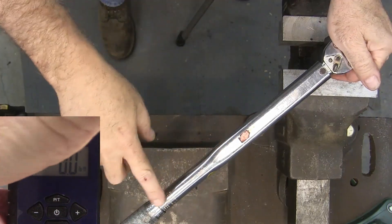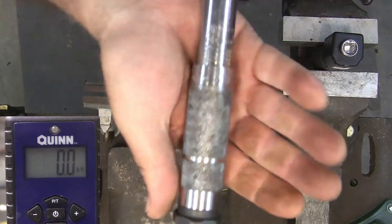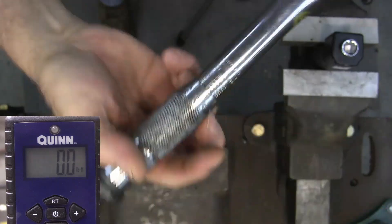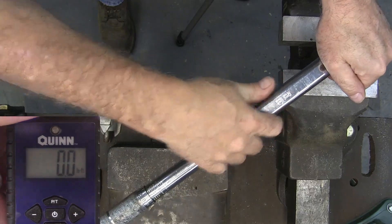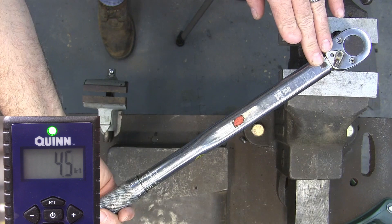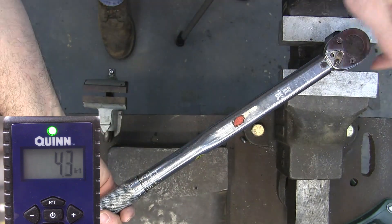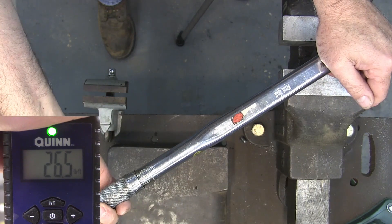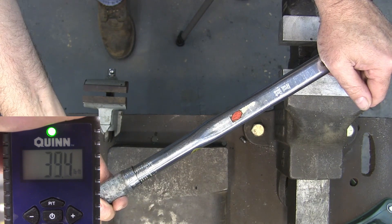This is the Great Neck, and it's set at 70 foot-pounds. I've abused this thing over the years, so I'm wondering — I'm not sure that I always lowered the spring pressure when I put it away. Let me see how accurate this thing is. It's at 70 foot-pounds. Wow. That is way off.